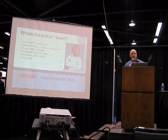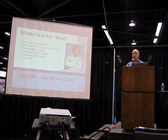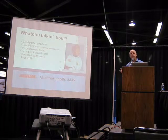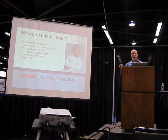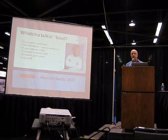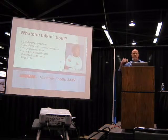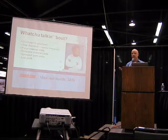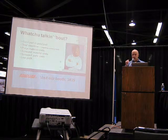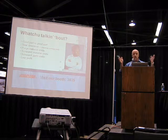When we're talking about purging, it's very important to understand that purging time is not just the time that the purge compound is in the machine, whether you're using regrind, scrap, or purging resin. The purging time is from your last good part to your next first good part. For example, if you're making bottle caps and going from red to white — when you take that last sellable red cap off the line to when you have that first sellable white cap off the line, that's your purging time.